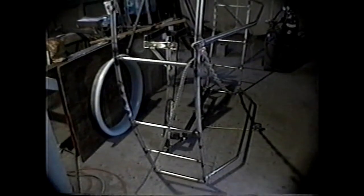You crank it up past the point you want it to be bent to. In this case, I built the guard too symmetrically, and I have to make it a little bit lopsided to handle the thrust line offset in this machine, which is an inch to an inch and a half to the port side. That's the way you can bend these guards with excellent control. It's just use this Spanish windlass. An overall view of the guard showing the air drive fabrication in position, and there's one of the fan ducts.